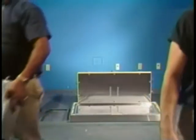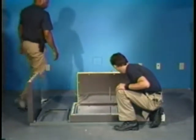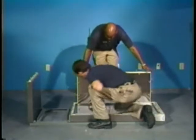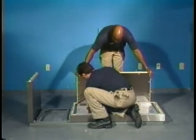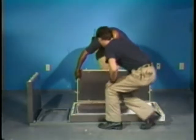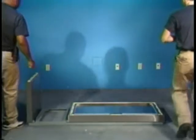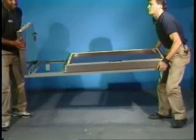You should now be ready to remove the rear panel. Begin by loosening the cam locks, first the lower right side going from right to left. One person should position himself on the left-hand side and one on the right side as both persons lift the panel free. All that remains is the base frame assembly with the left end panel still attached. Usually at this point the unit has been disassembled enough to get into most areas. It is always recommended to remove this panel. To remove this panel, tilt the base to the rear and remove the four machine screws located under the base frame using the flat blade screwdriver.